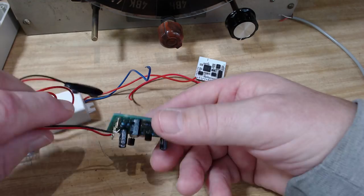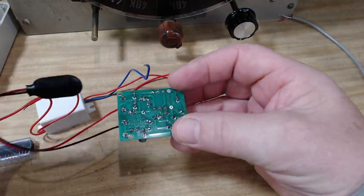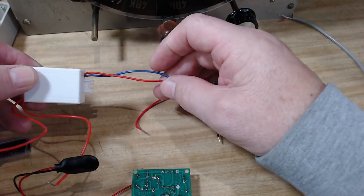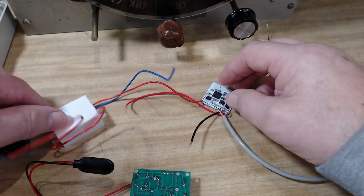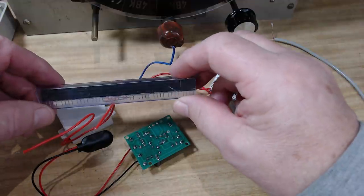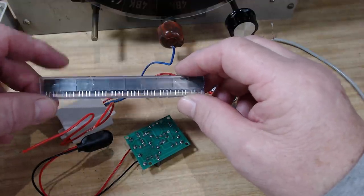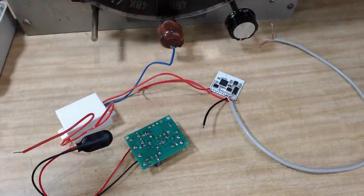This is what I was doing before Manuel came up with this idea — a little mono kit that you buy, only $10 or something. These are little 240 volt to 5 volt output modules. So I was doing much the same as he was doing but he did it in a much neater package. I was also toying with using the 6.3 volts and had already bought some DC to DC adapters. I think it would have probably been okay, but Manuel's solution was much neater than mine. I think he deserves a medal. Thanks Manuel.